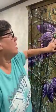We are gonna go ahead and finish up this cabinet, but I want to tell you a few things first. Now I'm gonna use polyacrylic satin. It's clear satin. You're gonna want to put this in a separate jar because it's already got a green tint to it. So if you reuse this, you don't want that on your next piece, especially if it's white.